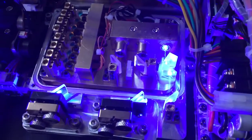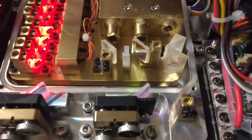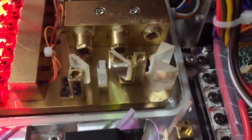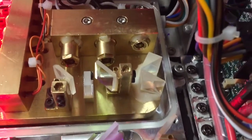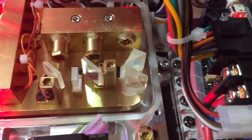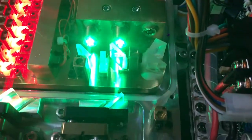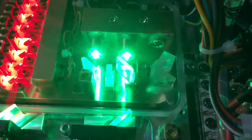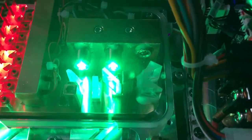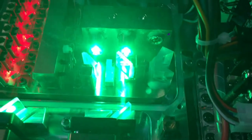I actually had to fix the two green ones to put them back on top of each other. There's also an interesting set of prisms in front of the blue laser, and that's to correct the rather poor output of the blue laser. The blue lasers are available in very high power single diodes - that's why there's only one. The least number is required, but they have to add some additional correction, because this is a nice laser. A cheaper one may not have that.